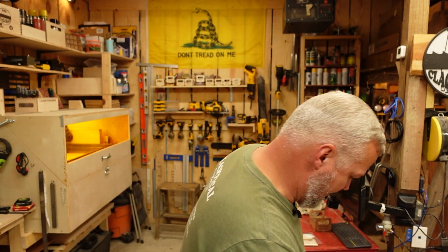And the reason I do that, guys, is for if I'm cutting something that is thicker than I probably should be, I can always drop this guy down, sacrifice a little clearance, but get a little more penetration through some of the thicker materials. So I had to have this once I took the cover off.